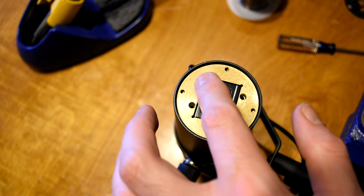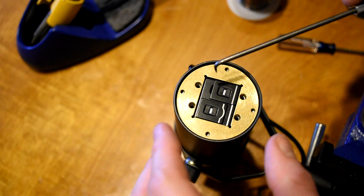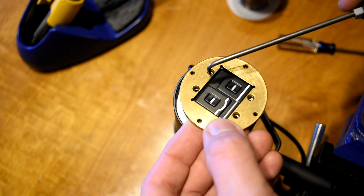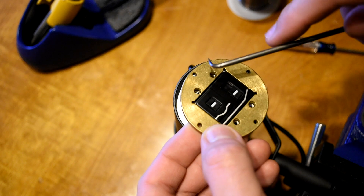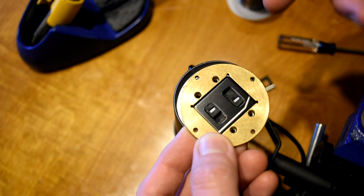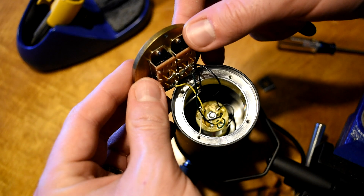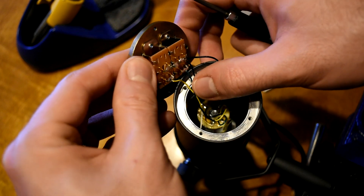Here's a tip: these four screws are very tiny and finicky. They don't want to come out. So I'm going to use this little pick tool to pull this entire assembly out. You can use a really tiny screwdriver, but watch out because these two plates will come off — don't let them fall down into the body of the mic. Just peel those off; they're metal and durable, and you can very clearly tell which one goes where. This is the high pass versus flat, and this is the flat versus presence boost. Inside you'll see two slider switches and four primary wires going to those switches.